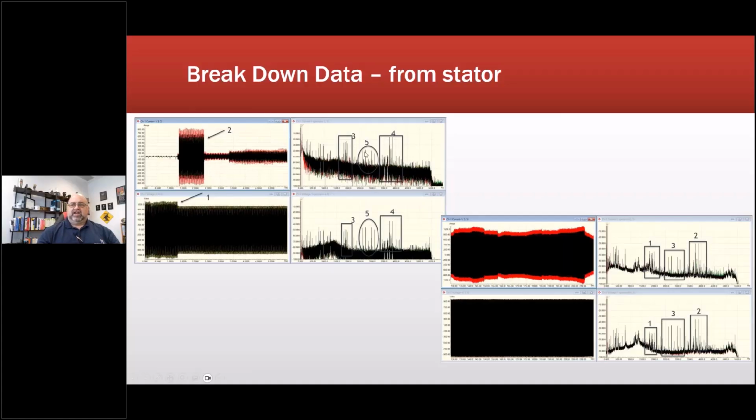And then this is the second. What we discovered later, through another engineer from H&N Wind on the team, was that it is a resonance associated with the transformer. So we're seeing a transformer resonance that's a direct result of a bunch of other stuff. This led to work that we completed on gassing in the oil-filled transformers of these types of turbines.